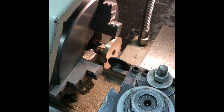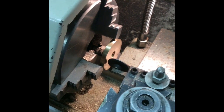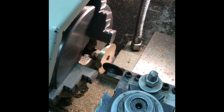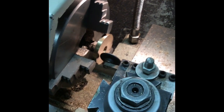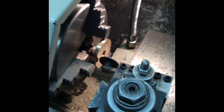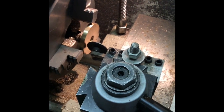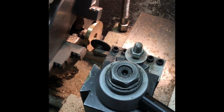Let's see if I can do this without screwing it up. What I'm going to do is true this piece of bronze up — it's an offcut. I'm down to my last offcuts from a cannon I made, and I'm going to use that for a bearing, but it's far too wide. I'll true it up in the three-jaw chuck using this little wheel — by pushing that into the face, it will true it up. Then I'll bore it out, fit it on a mandrel to turn the outside, and then bore the internal bearing surface.